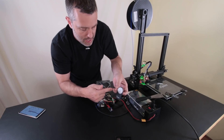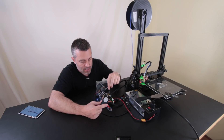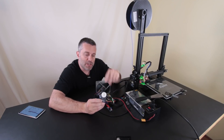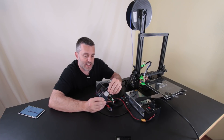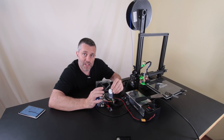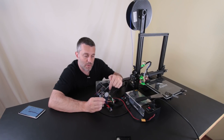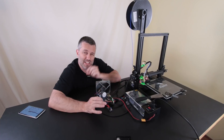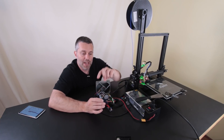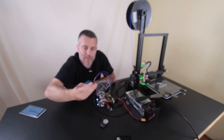What I want to do now is wire this into the Duet. I'm going to use fan pin number two — there are actually three PWM-controlled fans: zero, one, and two. I tried to power the remote through the Duet and run the micro circuitry off it, but it doesn't work. You have to keep the battery self-contained. You need to connect both leads to ground, but one of them needs to be switched. The negative terminal on the PWM fans is switchable, but here's the problem: it has a pull-down resistor circuit, which means it never gets to absolute zero. So you just cannot get it to work connecting the two leads directly to the board.